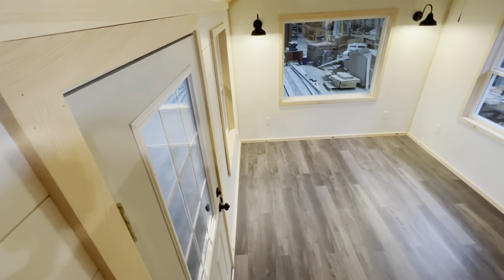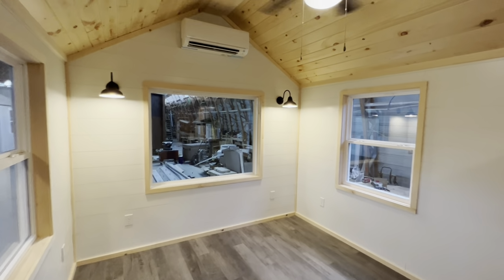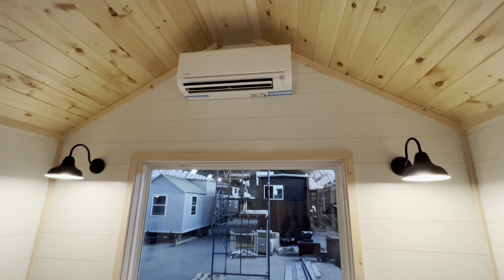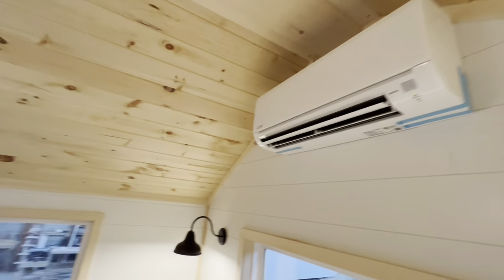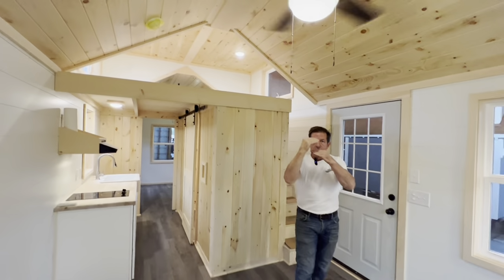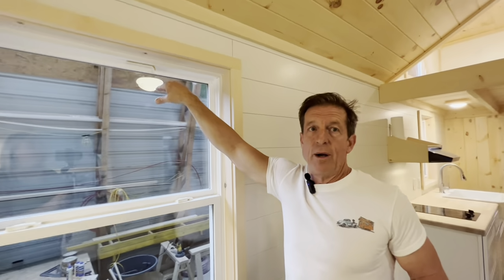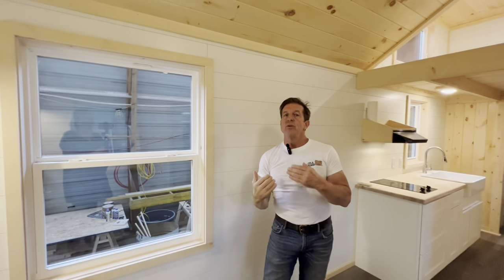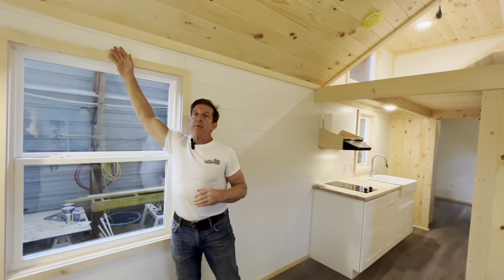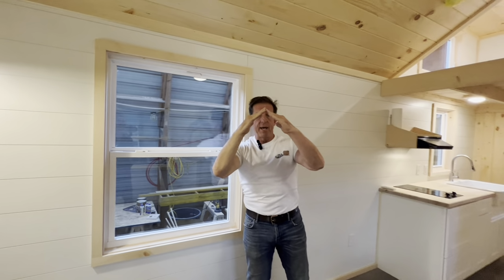I'm glad you pointed that out. When we were talking about doing a different design, there was so much. Believe it or not, when you add a 1x8 fascia board and you add the faux rafters outside, that brings everything down. If you don't watch, it'll all be inside the window. I see. We're still doing a little bit more tweaking on the design and the height of the walls. If you go up with the walls, then your roof line kind of squats.